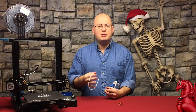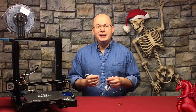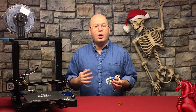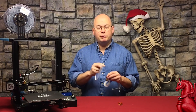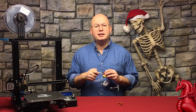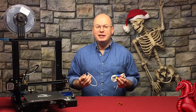I link it from Amazon in the description of this video and in my Ender 3 build video, but if it's already happened to you, you're going to need to clean out the entire hotend assembly. It's not hard — I'm going to walk you through it step by step — but it is something you're going to have to do, otherwise the problem is not going to be resolved. You can pull the Bowden out, replace the coupler, clean the end off, and put it back in, but you're still going to have plastic down in that void that's going to prevent you from shoving it all the way down to the back of the nozzle. You need to get that cleaned out.